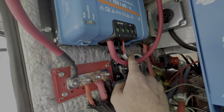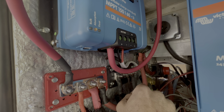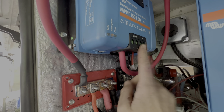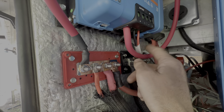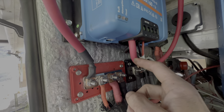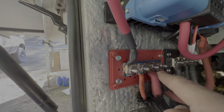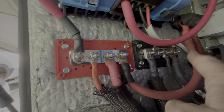We're reading 27.63 volts — right there. We ran a new solar wire from the top down through the pooper vent, which is a very convenient routing method. This is the highest voltage at about 92 volts, so your longest wire should be your highest voltage for efficiency. Then we ran the 24 volt lead up and around — you need a fuse, so there's a 250 amp fuse there — and back down to our bus bar. This bus bar is 24 volt only. One wire goes to the inverter charger, and another goes through a 250 amp fuse to the battery bank, along with an off switch, which is important.